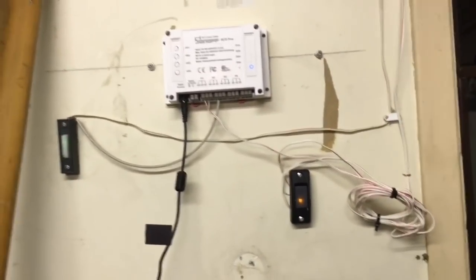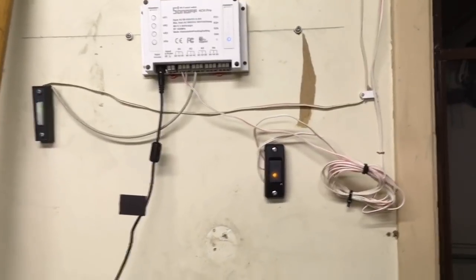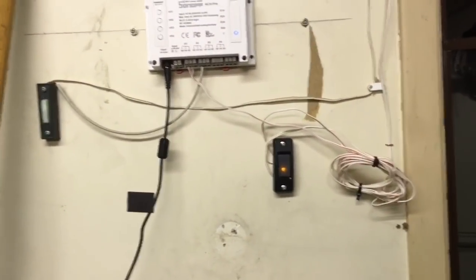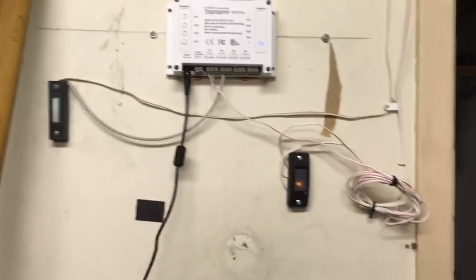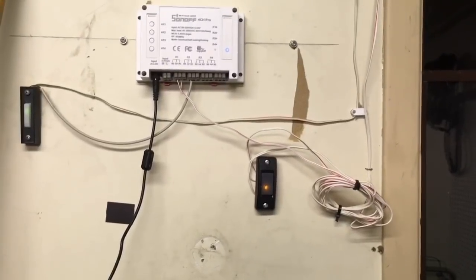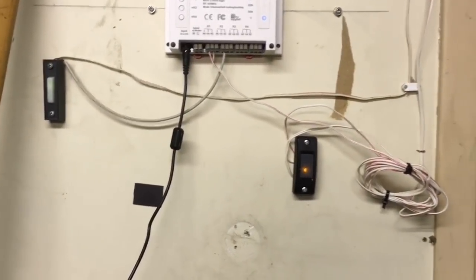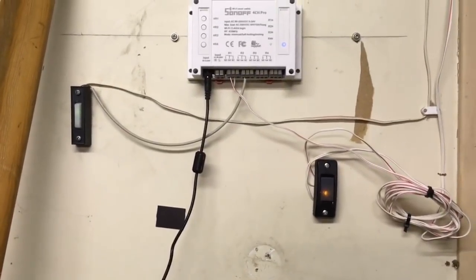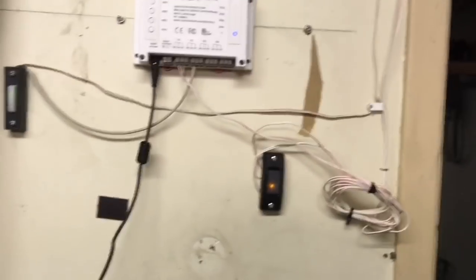This is something I'm currently stuck at, and I was reading a little bit around on the internet, and it seems that in newer models of garage door openers, I'm not too sure yet if specifically with mine, it's not just an open contact anymore, the button, and they are using some kind of serial communication with their button in the new garage door opening systems. And I was reading that sometimes, if you want to use a wall keypad, you need to use specific keypads that work with a specific model of the garage door opener. So I'm not so sure yet if my device is like that and that's why it's not working. Other than that, I was thinking if the load probably was too much, but it's the same configuration as the other switch that I have, and the other one works. So I'm really not sure.